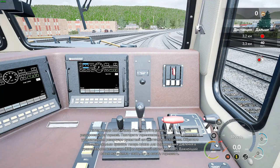This train has 100 cars. Let's see what difference this has on the reaction speed of the brakes. Repeat the equalizing reservoir reduction from before, again using the auto brake. Watch how long it now takes for the brake pipe pressure to match. The skill of the engineer is knowing when to start braking.